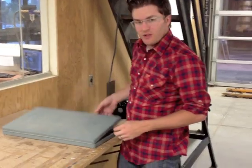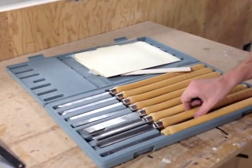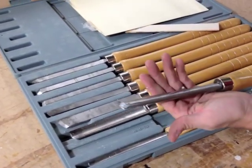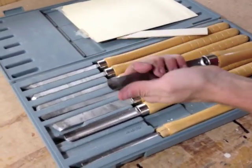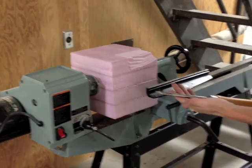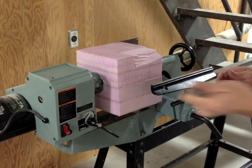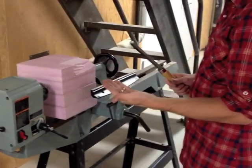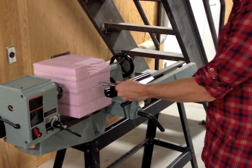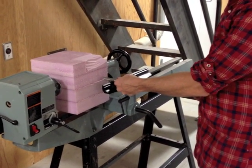So here are the tools in this little gray case. We're only going to be using this little guy here — these are gouges, these are skews. This gouge here is our medium gouge, and notice that it's round on one side and cupped on the other. The cupped side is the one we use to cut. The tool is going to be always in contact with not only our hand but also the tool rest. Our hand is also in contact with the tool and the tool rest, so all three at all times should be connected to each other. That gives us a nice stable anchor from which we can cut.